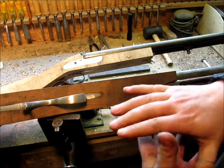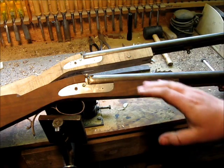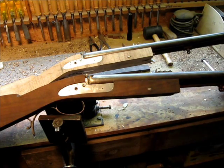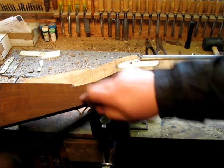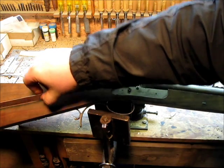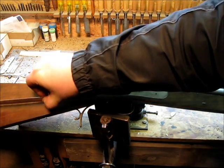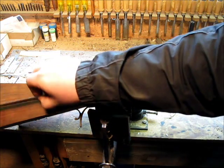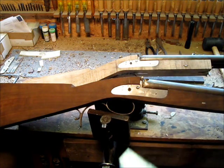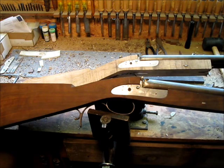I'll work all those quadrants down and tie them all together. Basically, the idea of shaping a stock is really just about connecting lines. What I mean is your butt plate is a radius, your grip section is a radius, and what you've got to do is tie those radiuses together so that they're smooth and straight down the whole curve of the radius. It's really just a matter of tying lines together all the way around. I'll show you how to keep everything smooth and straight and even across the plane.